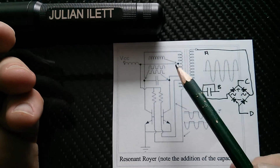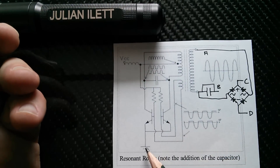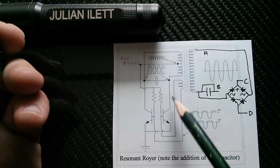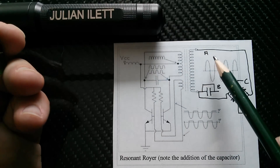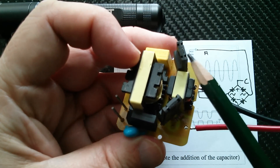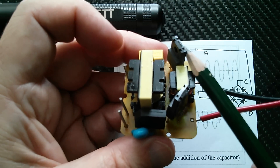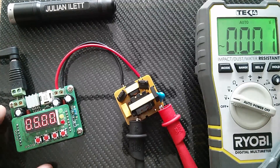Let's just look at the way this generates from a DC input — that's between the VCC point and ground — and generates an AC output. Because it's a resonant circuit with the capacitor and the inductor, it's quite sine wave like. One of the issues with that is that these transistors spend a lot of time in their semi-conducting region and therefore they do get quite hot. So here's my initial setup.